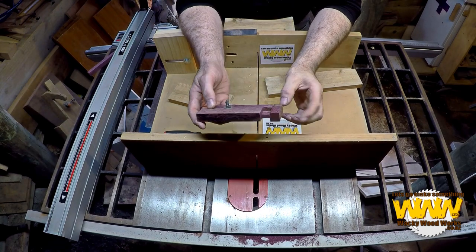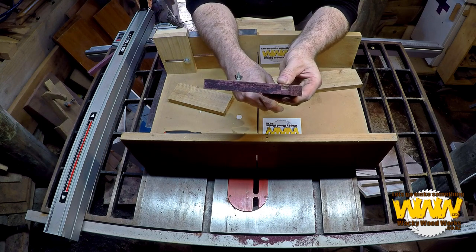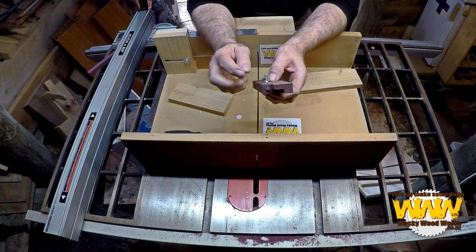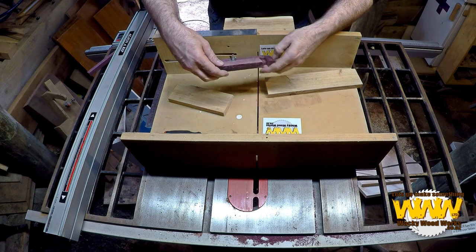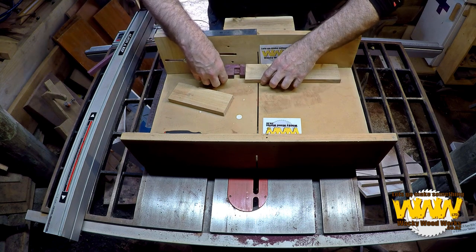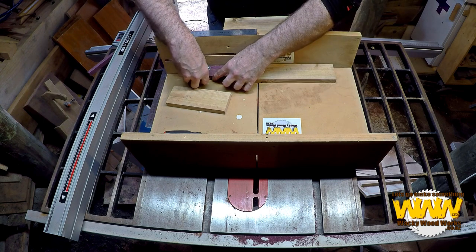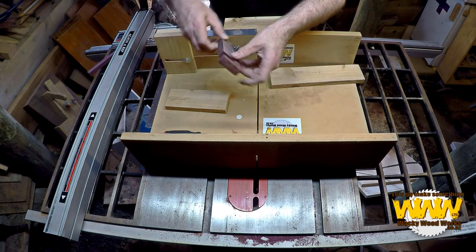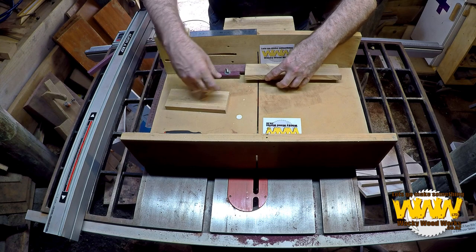Basically what we've got: a gap here is the dado size that I'm wanting. You've got a long side and a short side. The short side has got a set screw on it, which is the width of your blade — which is your kerf. So basically what you do is you set it up against your stop block, make your first cut, flip it round, then on the long side make your second cut, and then you nibble away in between.